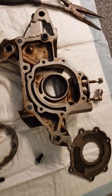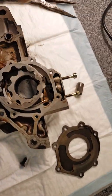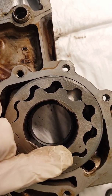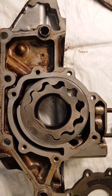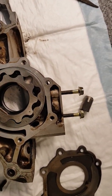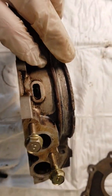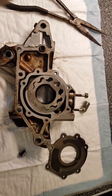If you find your pump's okay, the cog sits inside and there are dots on both of them. I'm not sure if they were timed or mated when I took them out. What they recommend when you put the pump back together is to prime them with Vaseline — packing all the edges with Vaseline or the equivalent. So then when the engine starts, it's lubricated. That's how an oil pump works.